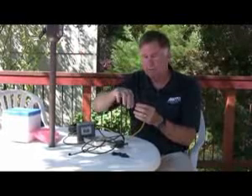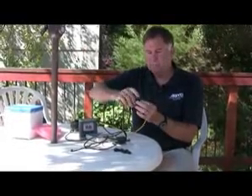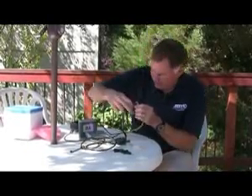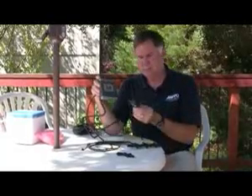It's really important to keep this linear form. If you had a bunch of stuff in the stern of the boat and a bunch in the console or wheelhouse, you can break the bus and put in a drop cable between T-connectors to extend where they are — they don't all have to be in the same spot. My display is now showing zero fuel flow. You're probably not supposed to do this, but I'm going to blow into my fuel flow meter — and you can see it's already going. That's a really simple system.